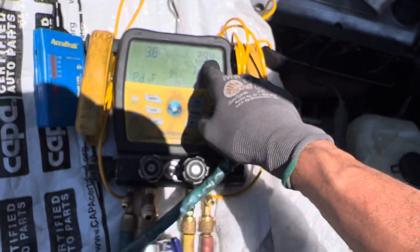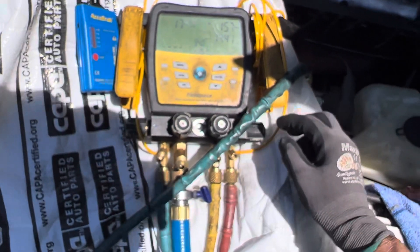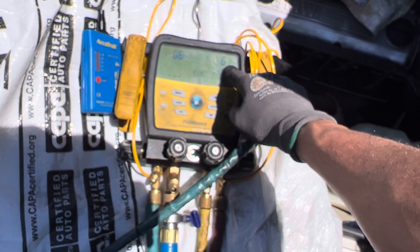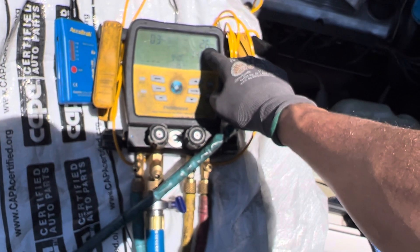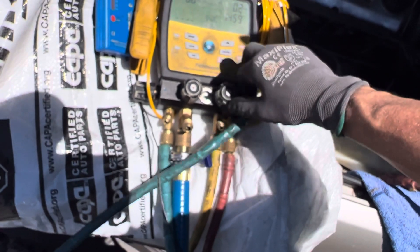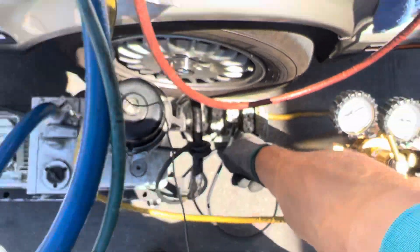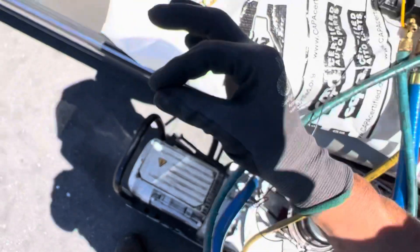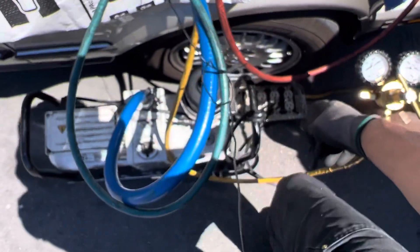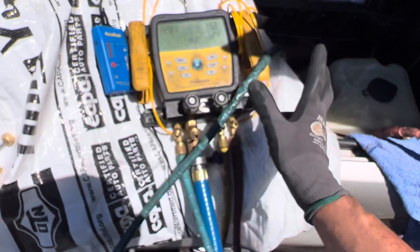I'm going to wait for the high side to go near zero, because vacuum pumps were not meant to compress pressure — they're designed for atmospheric conditions, not to be force-fed more pressure than they were designed for. I usually wait until it drops to about one PSI and then I start the vacuum. Now I'm hitting one PSI, so I'm turning off my nitrogen line and turning on the vacuum pump. Have you noticed I don't use my switch? Because your switch has contact points and the more you turn it on and off, you wear it out — that's why you only use the plug. Now open up the low side and start the process. We'll have the next video coming up next.